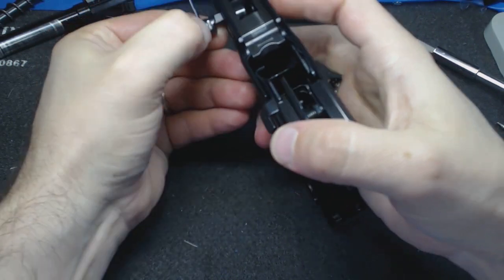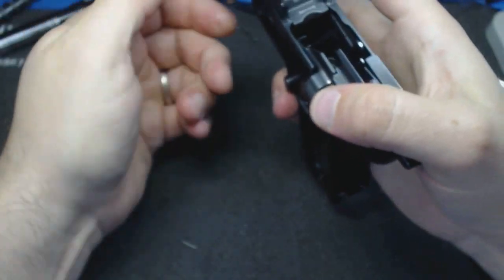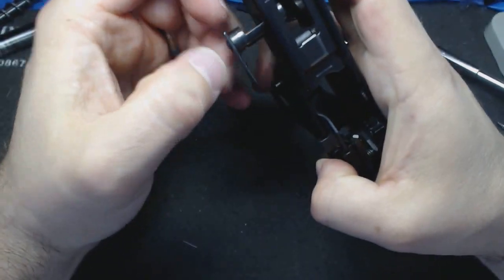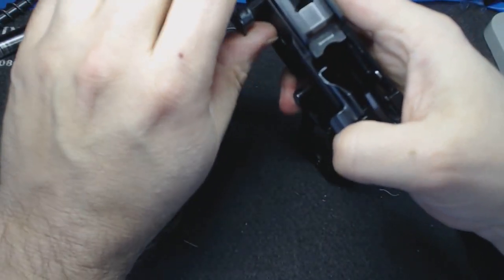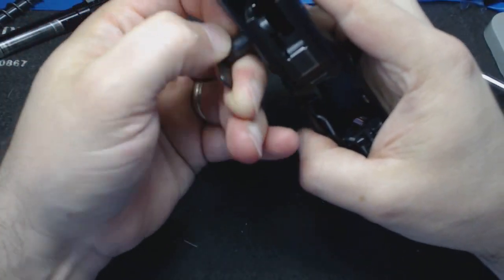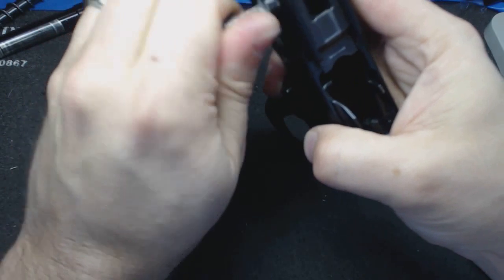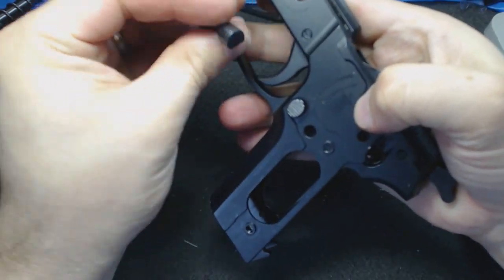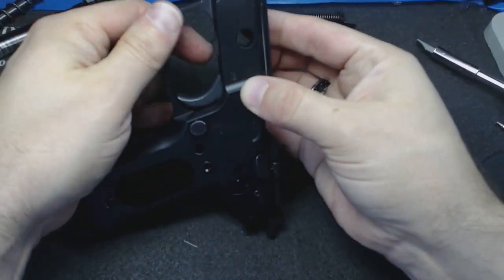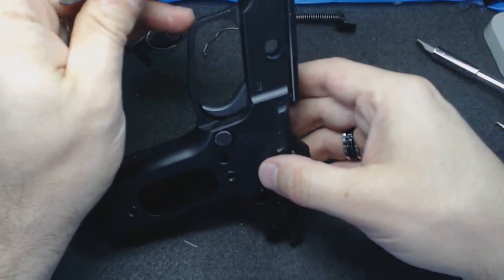So these are the grooves that I was just talking about. One groove there, one groove there, and a spring that we can't quite see yet that engages them. But as we rotated that, these other surfaces that don't have grooves were in contact with that spring and pushed it out of the way. Same thing for getting it past this next stage. Once you get it in here, if you just rotate it, you'll hit a part which will push the spring out of the way, and you'll feel that, and you can just keep twisting it all the way off. And now that we can see it from the side, this spring here that just intrudes on the hole a little bit is what's providing all that tension.